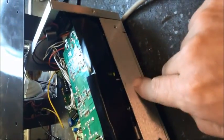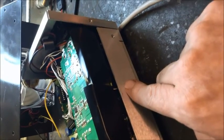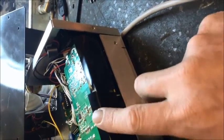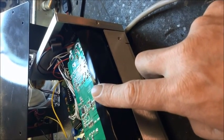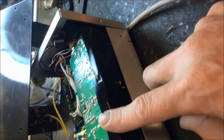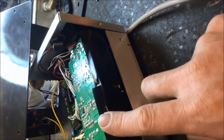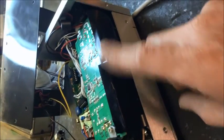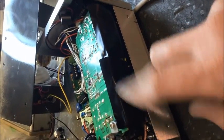So what we did is we're utilizing the one power supply that all the other guys are using, and it's on the bottom, and I'm only pulling my 15 plus and my 15 negative off of that. And then this right here is my old 24 volt supply that I originally bought. And what's funny is when I key down, it stays right at 24. It never drops a lick. So that was a win-win for me on that.